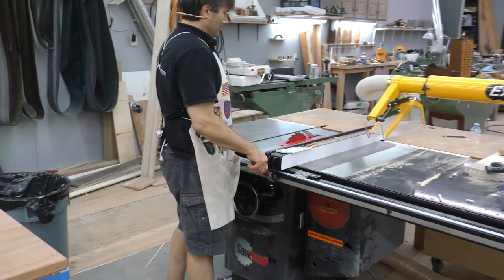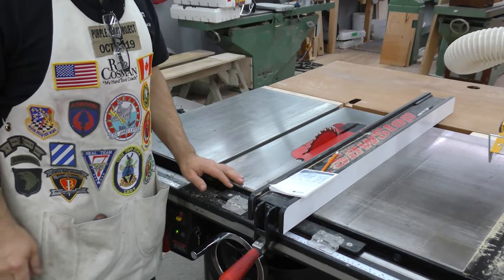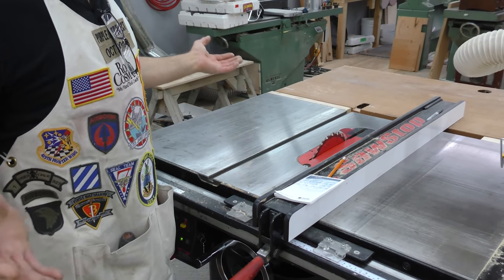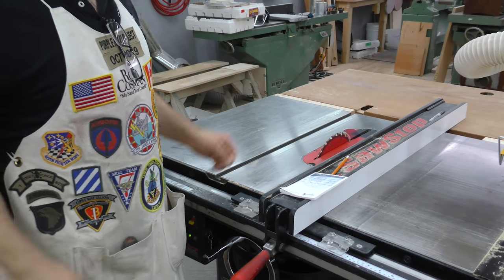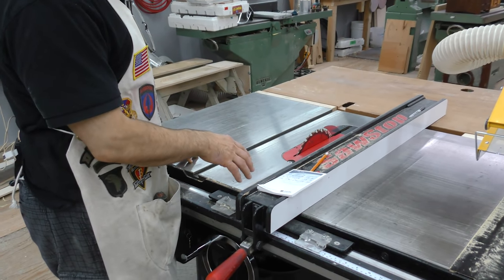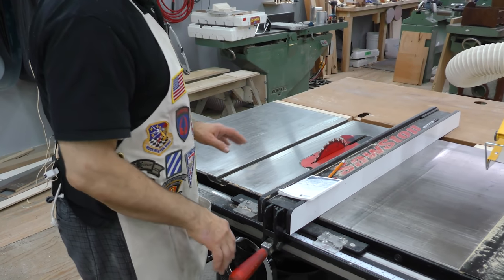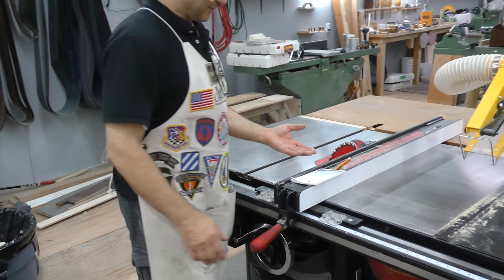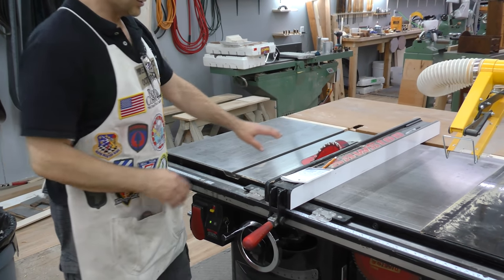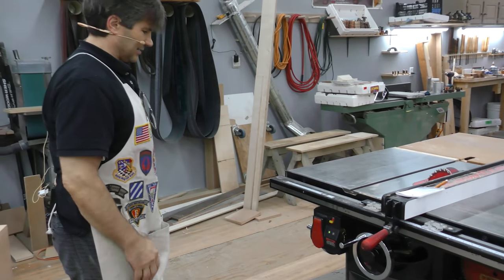In case you're not familiar, most table saws prior meant that the blade tilted into the fence. So if you were trying to cut a miter on the top of a chest of drawers, when you're cutting your first one you're trapping a piece of wood in there which is very unsafe, and then when you go to cut the other one you've got the point of the miter that's going to slide underneath the fence. Cutting with the blade tilting away from the fence is a huge advantage and the more you use it the more you come to realize that.